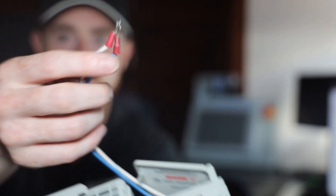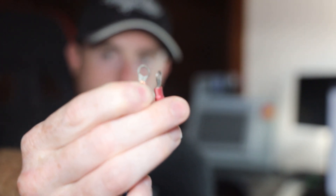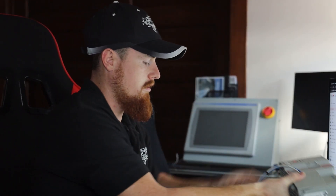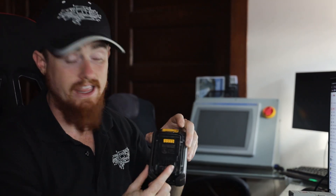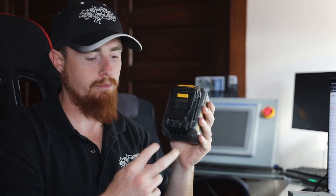So basically we take our little knife terminals like we have here on our PLC — because this is what we're actually utilizing to fire this up — we just have some little eyelet-type terminals right here. And we're putting them right into that positive and that negative. Prior to ever using this, we put a volt meter on it to test that it is our positive and our negative.